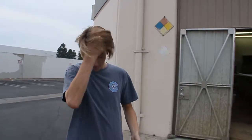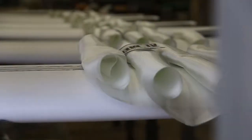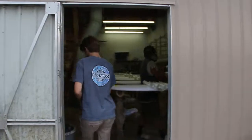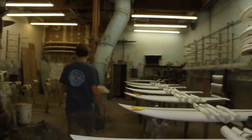It's like a burning sensation on your hands with acetone. I didn't even know you could put acetone on your hands — I thought it was dangerous. Apparently not. You're supposed to set Futures with jigs, not like FCS, because Futures actually have the angle built into the fin, whereas FCS is always 0 degrees and then you have to tilt it and tape it off.